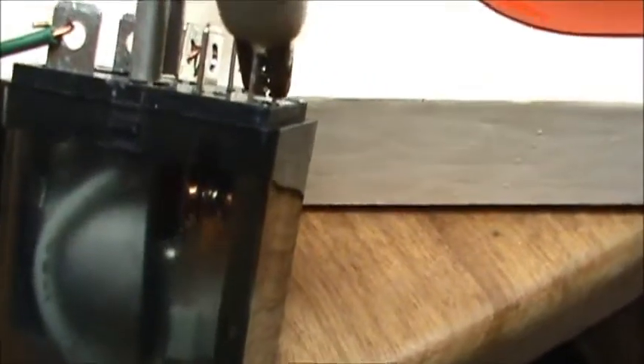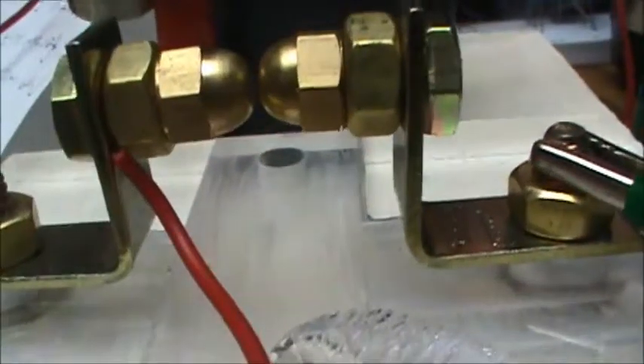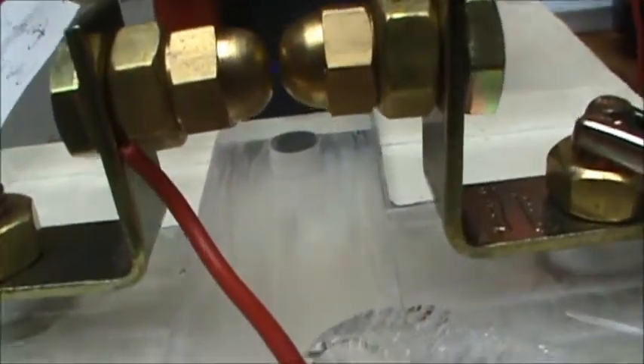Now if I change the connection on the relay — the left-hand side is the low voltage area — if I move this battery positive terminal connector down over here, you'll see those two are bridged together. These two on the left that stick out to the sides are for the coil, and this jumps the gap over to the plate. Watch what happens now when I throw the switch — the contact switches. And this is what I want to happen.